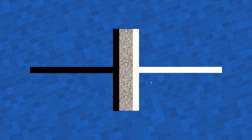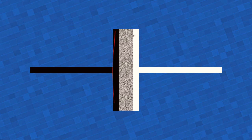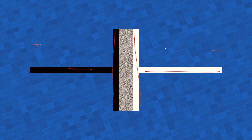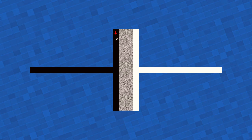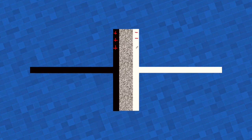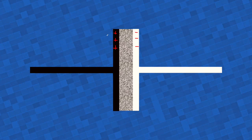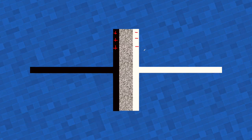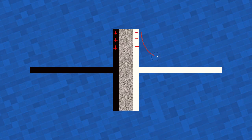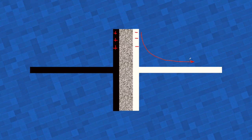This is a simple diagram of an aluminum foil electrolytic capacitor. Basically you have two plates connected to the respective terminals. This is the positive terminal and this is the negative terminal. So this plate here is the anode, and on this plate positive charges accumulate, and on the other plate, the cathode, negative charges accumulate. So the capacitor works like a little battery.